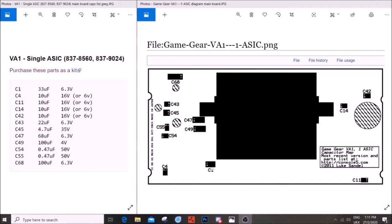When you're applying your new capacitor down here, you're going to notice that on modern capacitors, some of them have a longer positive leg, and the shorter leg will be the negative. If it doesn't have that, it should have a white strip with maybe black arrows or even dotted lines, and that will indicate your negative side. Remember to tin them up nicely, shorten them to the right size, and bend the legs over, and it should fit fairly nicely in there.